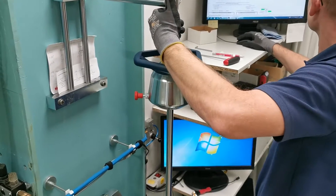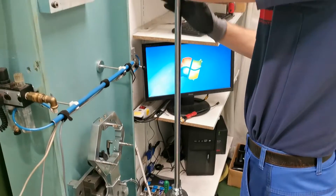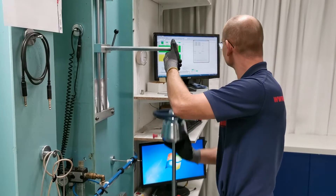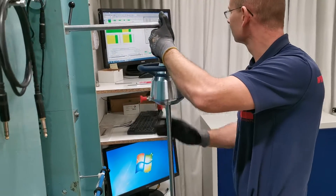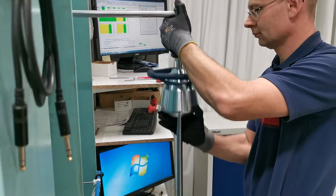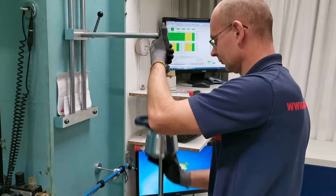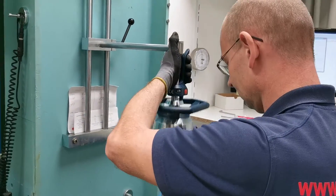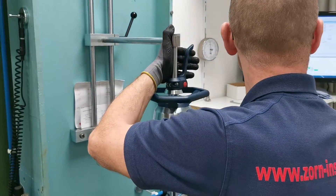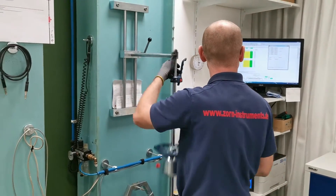What happens exactly during a calibration? We look at two variables: impact — that is the maximum force with which the drop weight hits the load plate — and impulse duration. For this purpose, the so-called loading device, which consists of the drop weight, a guide rod, and a set of steel springs, is first placed on the force measuring device. Then three series of measurements are completed with 10 impacts each. Impact force and duration are automatically transmitted to a computer, and the measured values are documented in a special program. This program also calculates whether the values comply with the calibration standard.